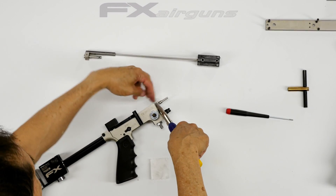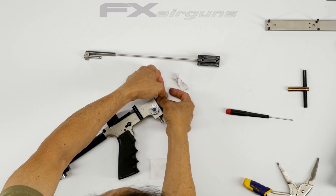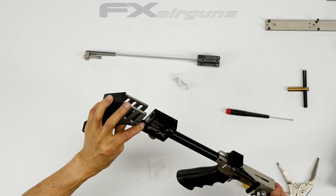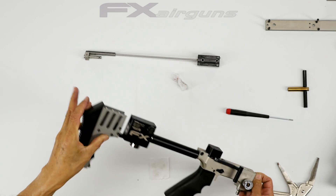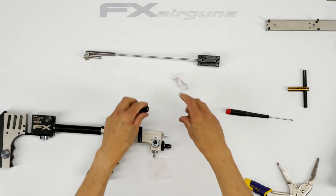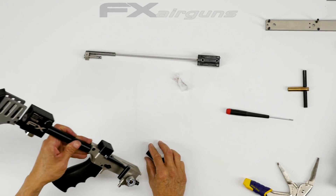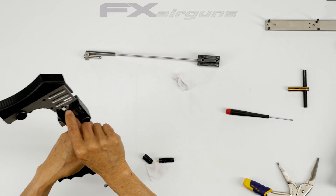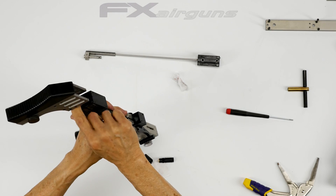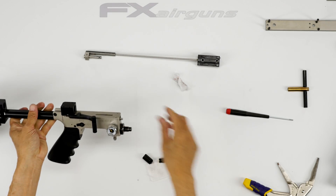Keep the vice grip as you let it go — the spring wants to spring back and you don't want that, because sometimes when it springs back it doesn't go into the little bore hole. You don't want to nick the end of the rod. Make sure the whole rod is seated in the back — you can rotate it and it pops in, and you can see the end of the valve, flush.